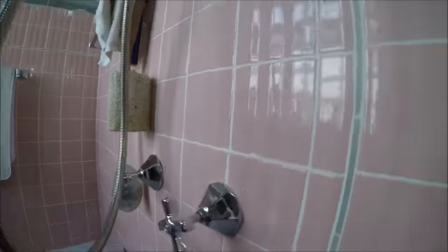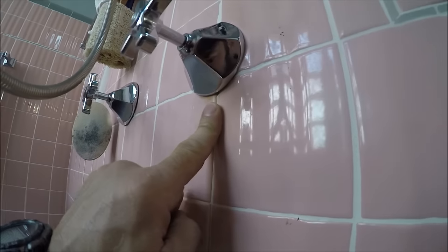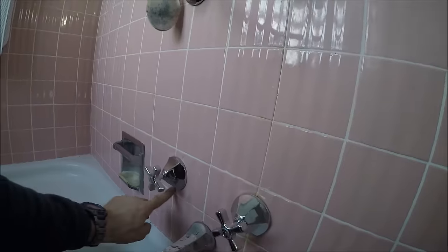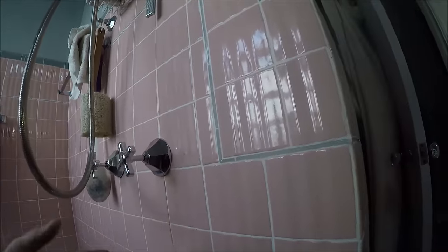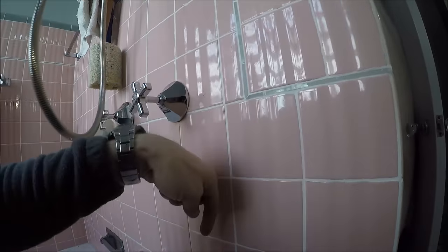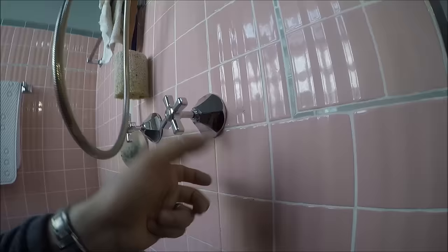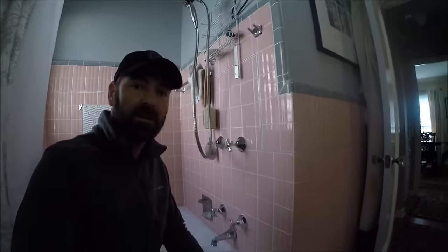The last thing to do on this little project here is to caulk these in. You can see there's a pretty decent gap just by the shape of the tile and the orientation of the valve system in there — it's just a little bit off, not perfectly aligned with the tile. One thing I'm not going to do is caulk the underneath side. I'm going to leave that grout joint right there open, same with this one, this one, and this one. If these packing nuts ever do start to loosen up a couple years down the road, you want a way for that water to drip out instead of going behind the wall. And if you start seeing that little drip, you know that all you got to do is back this out, snug down on that packing nut and you're good to go. So this project is done.